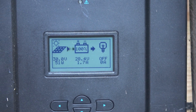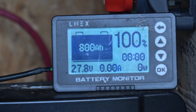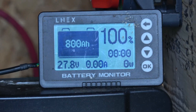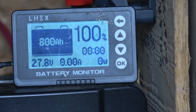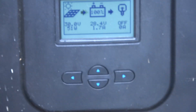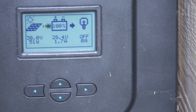Batteries are 100% charged, so that helps. It's a 24-volt system and it's currently putting out 28.4 volts, so it is maxed out. I've got 800 amp-hours of battery power and it is 100% charged with zero amps coming in or out right now because we're outside and everything's turned off. My friends, I have fixed my solar array — tomorrow when it's fully operational we can go back to using all the stuff.